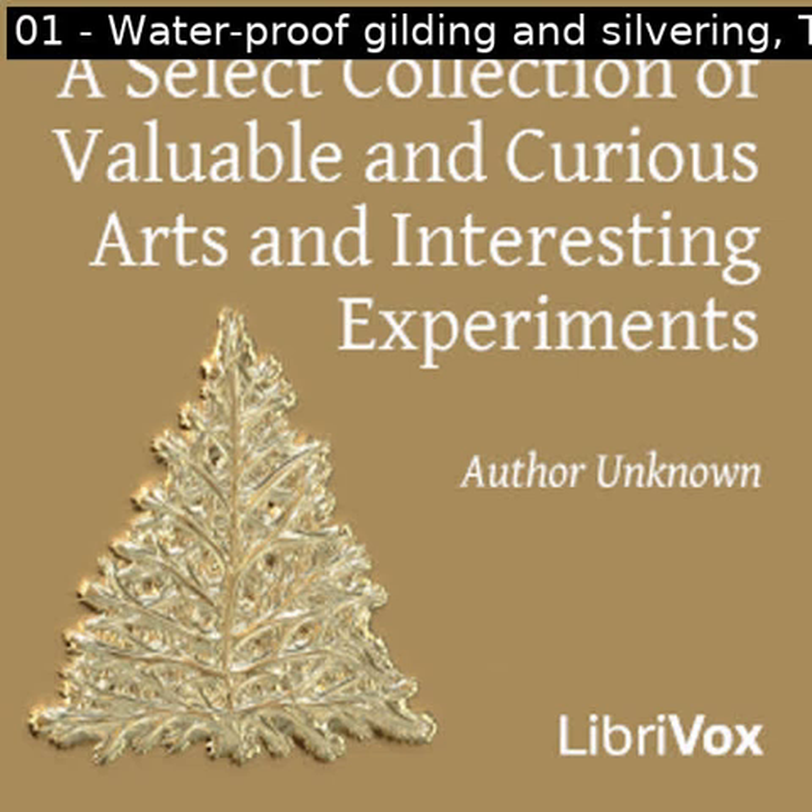Thus any figure may be produced in a variety of shades by applying the bronze more freely to some parts than to others. If some internal parts of the figures require to be more distinct, they may be wrought by their peculiar patterns or edged with dark coloured paint. In some work it may be well to extend the varnish no farther than the intended figures; projecting or branching parts may be drawn with a camel hair pencil. In either case the work must afterwards have one or more coats of copal or shellac varnish. End of section one.